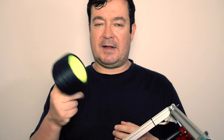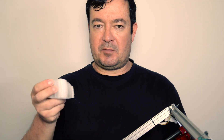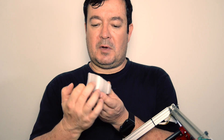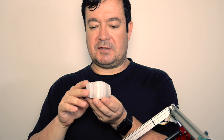I found this model on Thingiverse with a nice road wheel for a skateboard, and I wanted to print the rim on my belt printer. I'm printing it in white clear PETG so it will be nice and strong. But when I got to this point here, this height, I started getting skipped steps, and the print started moving in this direction.